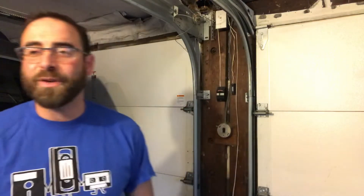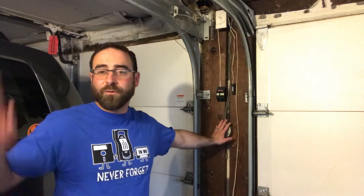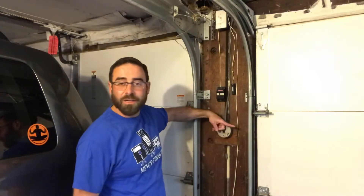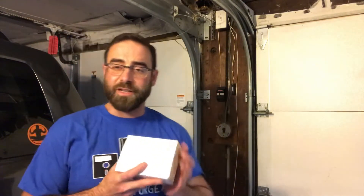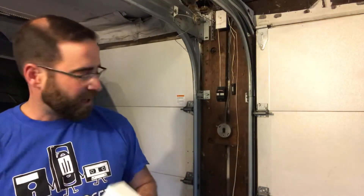Today we're going to install a three-way smart switch. This is a switch I have in the garage - it is one of two; I have one upstairs. The way a three-way switch works, it really just toggles connection points back and forth. If you get the right smart switch, you only need one of these. I'll have the smart switch down here and upstairs will just be the regular switch, and it will know whether it's on or off.